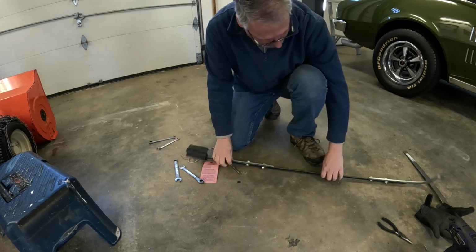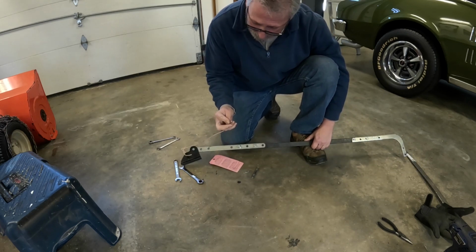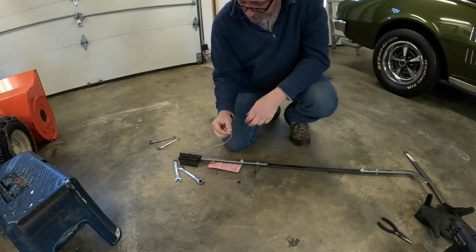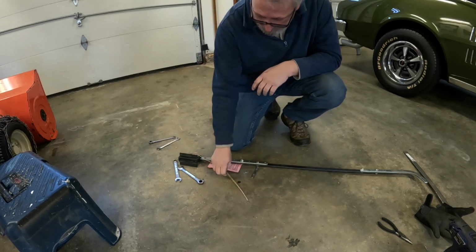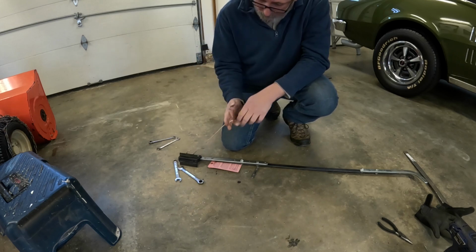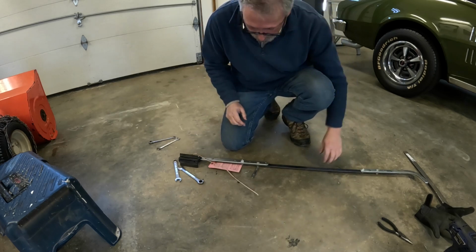Well, all right. Now I just got to put it on. And I don't know if you noticed, but I took the knob off of this. And the reason for that is if you leave your knobs on, somebody could, and it's not likely, but somebody could take a piece of something, slide it between the building and the garage door, hook it onto this, grab the knob, and pull this to release it and get into your garage without having to activate the opener.